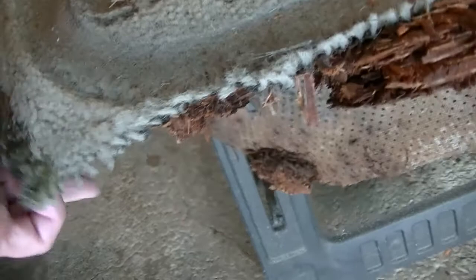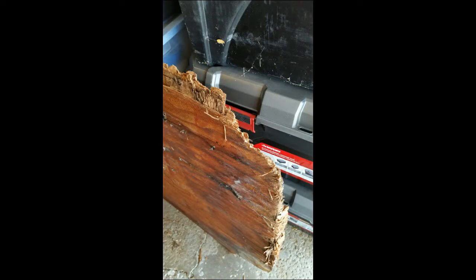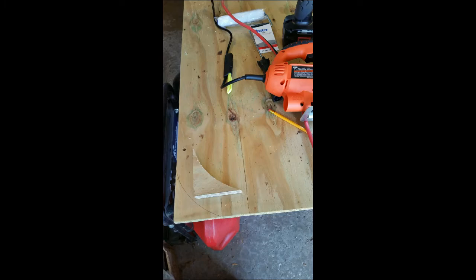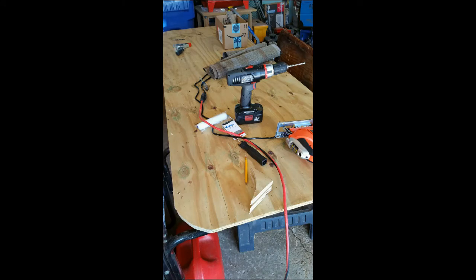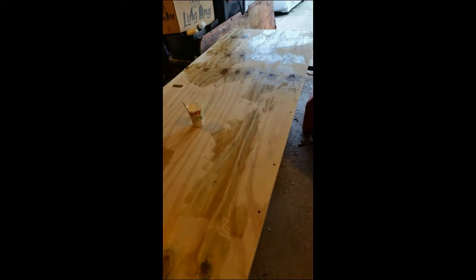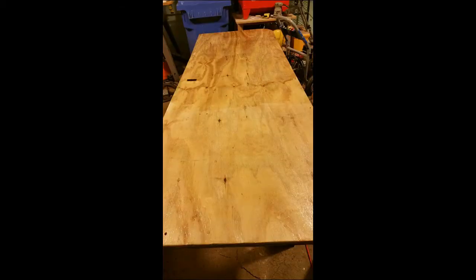As you can see, we have significant rot. It's time to replace it. I made the new backing board for the hatch using the old one as a template. On the corner that was extremely rotted, I cut the other corner that was not rotted and then used the cutoff piece as a template for the rotted corner, so I got the same curves to be used. Then I coated the wood, both sides and the edges, with resin to protect it for the future.